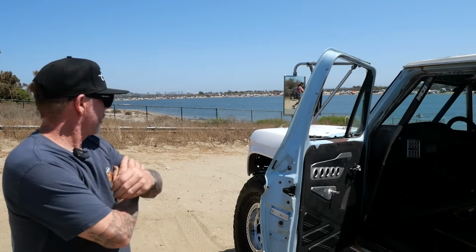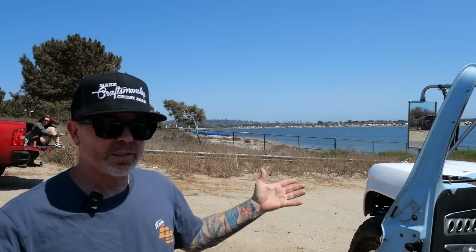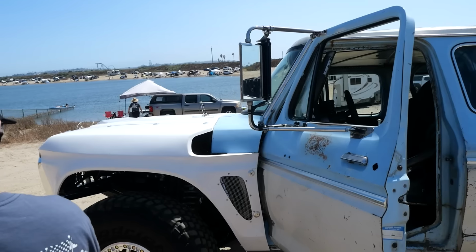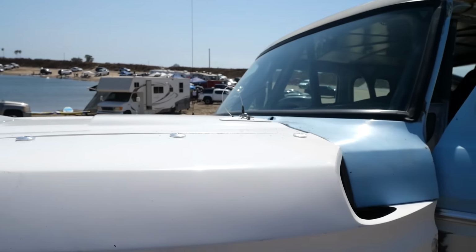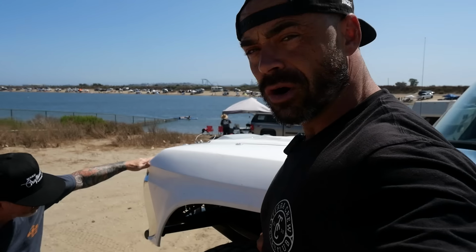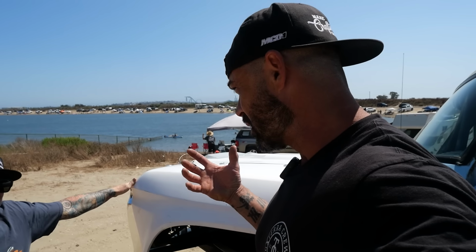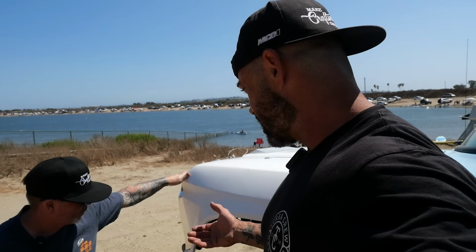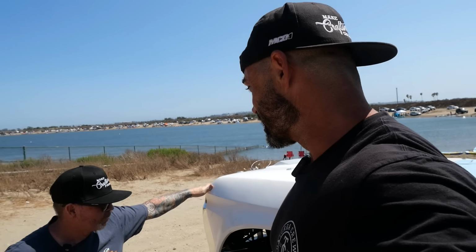I say we start with the beginning, like basically a new chassis from Jubera Fab back, right? Absolutely. What that looked like, you can see Jubera center mount in here. And I say Jubera frequently here because I don't want to discredit them. We did rebuild the crap out of this truck, but no matter what, that suspension and their steering and stuff has held up. We built new upper arms out of chromoly just because there was a failure. It's not unusual that an upper arm fails, but I just want to make sure they have credit because the front end of this thing has really never changed.